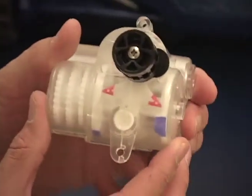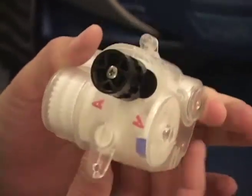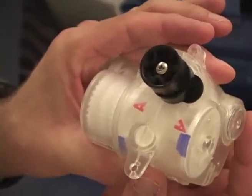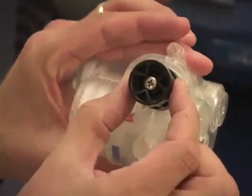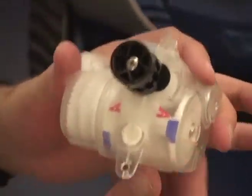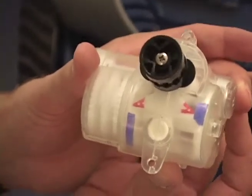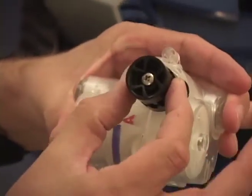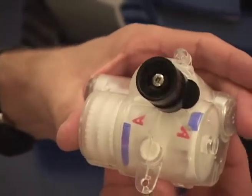So a couple things to remember about the MX8 direction control device gearbox. When we move into the neutral position, this is just the time between forward and reverse. Just because the pulley moves back and forth very loosely does not mean anything is wrong with the gearbox. It's just the neutral position. If you continue to move the gear in the back around, it will push into the reversing direction. And then as you continue, remember there's another neutral position as it goes from reverse back to forward.